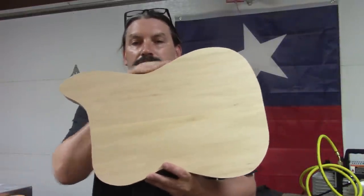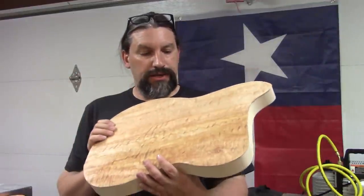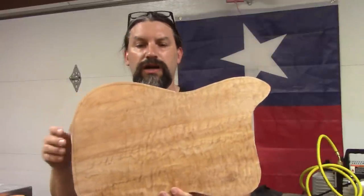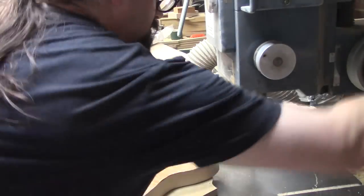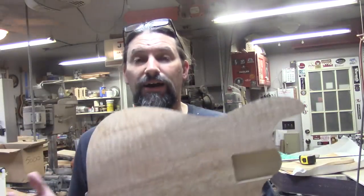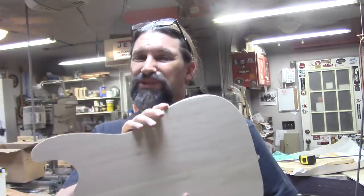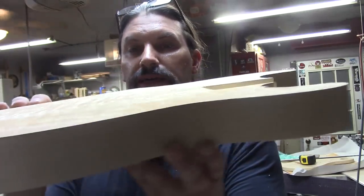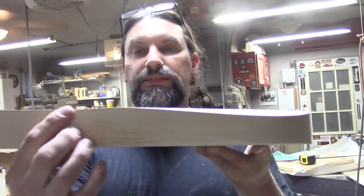So we went from a fairly boring basswood body blank and we went to a full-on custom quilt job. We can attach a template to the back of this now and either finish out the edge on the pin router or do it on the shaper. Our veneer top super strat looking thing is done. Remember this was basswood on the back — pretty ugly, but it's wood — with a really cool quilt maple top veneer on top. As you can see, the vacuum rig sure did a good job sucking the top down to the base structure. All this will get cleaned up on a sander.